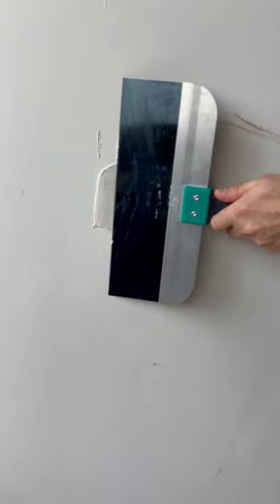The puck system is beveled so that it slides perfectly into the wall, and when it's mudded in and then mudded over and then sanded and then painted, it disappears. They specifically said it didn't need to be taped. We're a little suspicious of that. And where's our other puck?